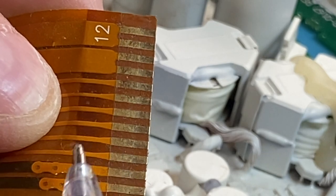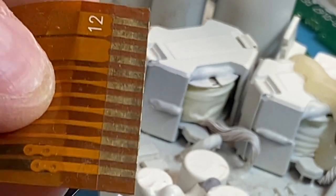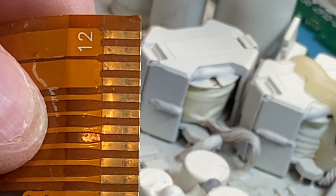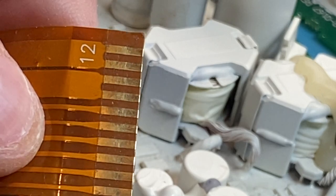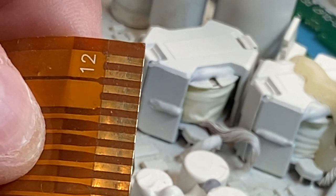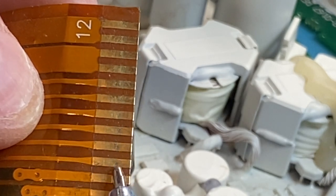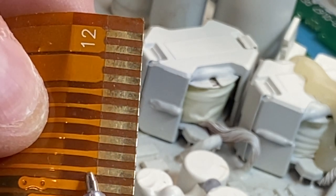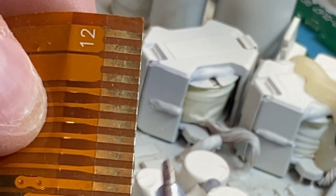If your mylars start playing up, which is so damn common, these things are, yeah, one of the biggest failures in these detectors is the mylar strips. But, you know, you can do bush fixes. You cut it, don't cut it right there because it'll get too close up there and it's insulated. You just want to take a trim right off the bottom.